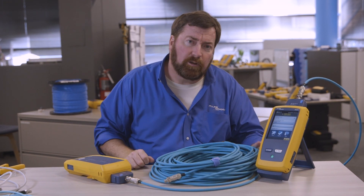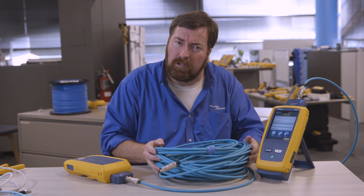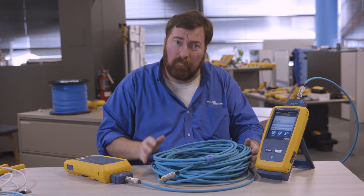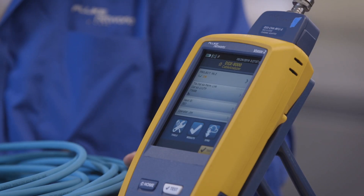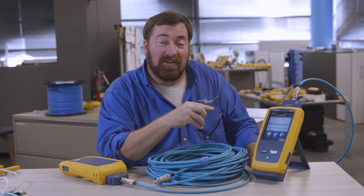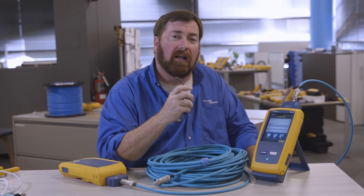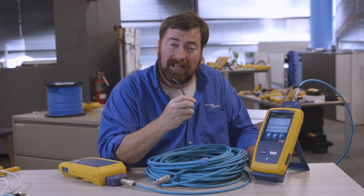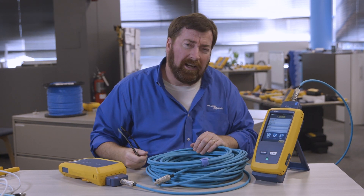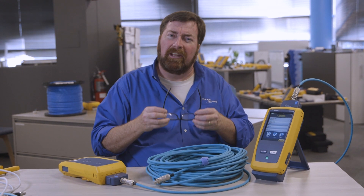I could use a patch cord limit, but there's a problem. When I have this longer cable, if I use the patch cord limit, sometimes we start to see failures at low frequency levels. When we do a permanent link test, we compensate for this with the 3 dB rule. So with the ISO — the International Standards Organization — 11801-3, that is the cabling standard applied to industrial environments, they're working on a draft standard of a very interesting limit called end-to-end.